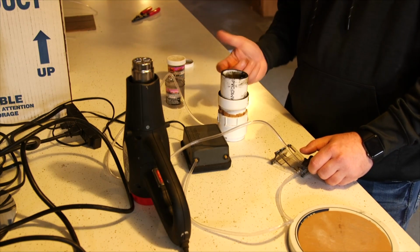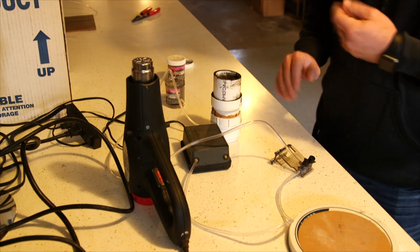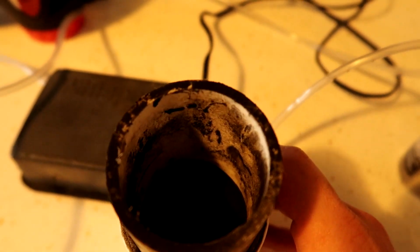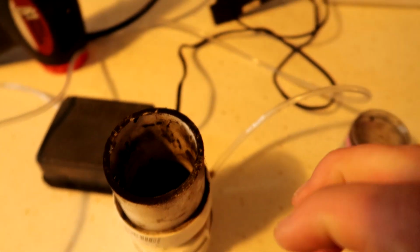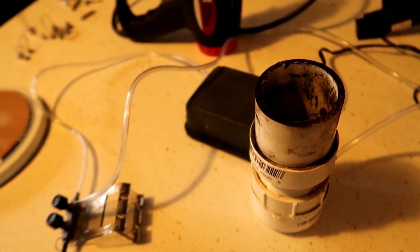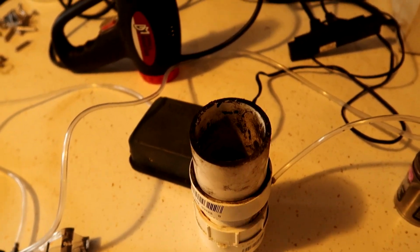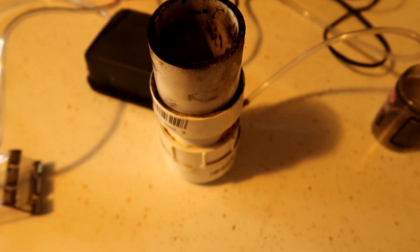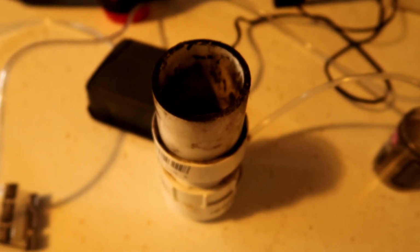If you see paint coming out of there, you've got too much air going in. It's really tough to see in there, but with that air flowing around, the particles of paint almost float because they're floating on air. It creates some air space between those paint particles. So when you dip your lure or jig head down in there, it allows the paint particles to go around it, as opposed to you compressing or compacting the paint and using too much.